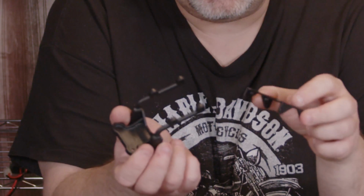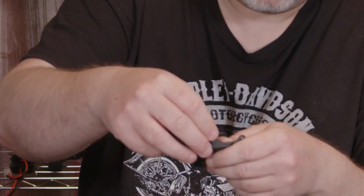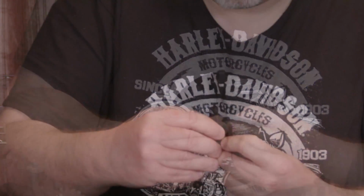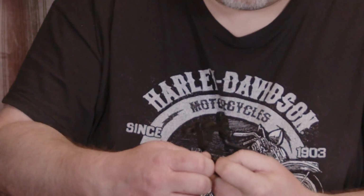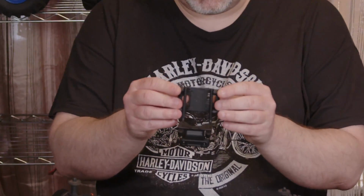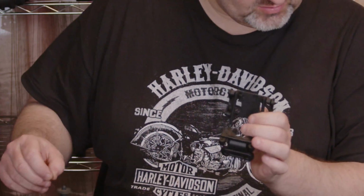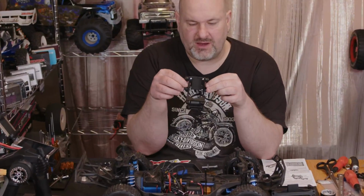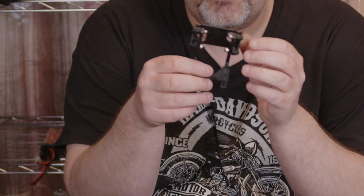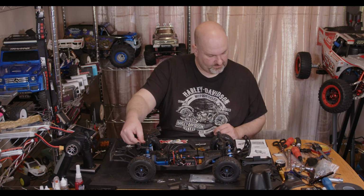The next thing we're going to do is you've got the locking plate, and that's got to be mounted on here, and then you've got 4 of these little spacers. So you're going to want a spacer, and then the locking plate, and then you've got a 20mm button head bolt that goes straight through it. So basically they're going to go through and then come through into the actual mount. Right, so that's going to be the next step. So 4 spacers, 4 20mm button head screws, and then for each one of those screws you have a lock nut. So basically that is how we need that assembled. 20mm bolts, your locking nuts, your spacers, all 4 of them, and that is how the mounting mechanism goes together. It looks like it's going to mount in that orientation, but we need to see.